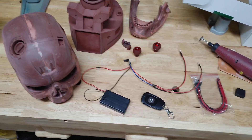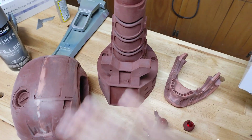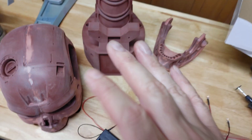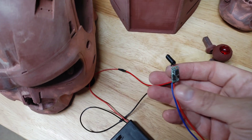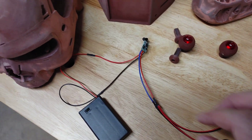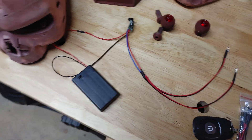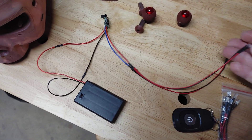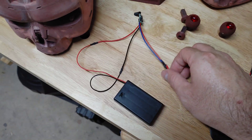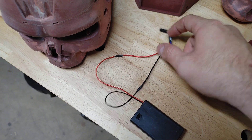Really cool setup for the eyes. I kind of ran into an issue with the base — there's really not a good place to put a switch in without drilling and taking out a bunch of material. So instead of adding a switch for the lights, I decided to go the wireless route. They now make these really cool wireless chips that come with a remote. You just hook your lights and your power source to that and you get lights. It's really simple — it has an input for your positive and your ground, and then the same for your LED lights. You just cross both your positives and both your negatives. I already soldered them there and they go right into the output wires to the chip.